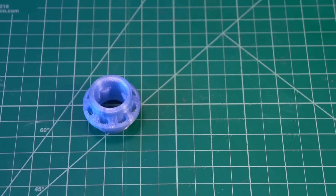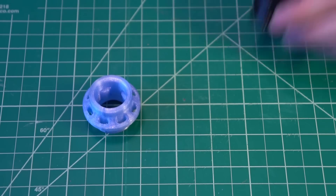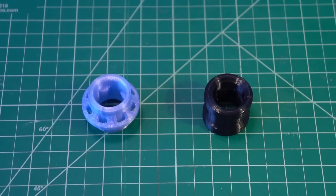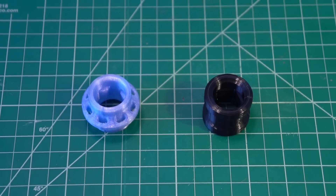I've also designed a new core. In addition to the original mid-style core, I now have a triple round-style core. The new core is more in line with the modern zeitgeist of wheel design, it's easier to print cleanly, and if your bridging is good it can be printed without supports. The whole system is printable without supports because I don't like wasting plastic.